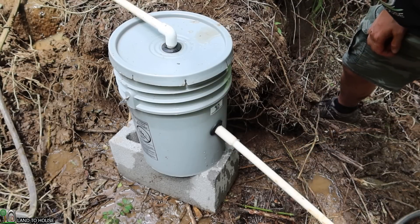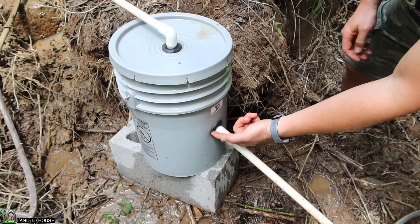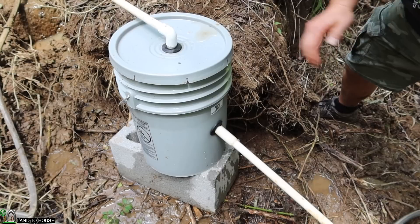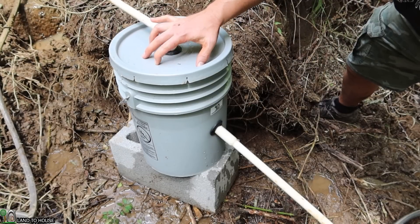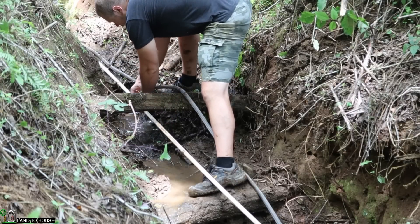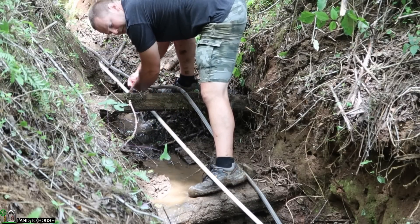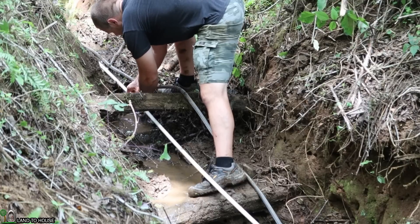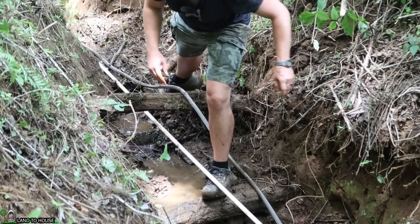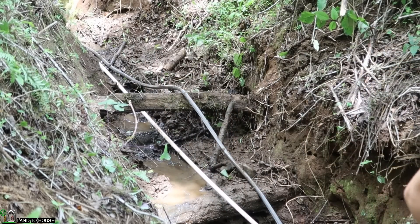Now because that has the head pressure drop down, it actually just pulled the bucket all the way down to here, but we'll work with that in a minute. The ram pump's not going to use as much water as is coming in, so we'll have plenty extra. Before we glue this, we're just going to do a test run. I'm going to connect another section of 20-foot pipe to the previous section. The half-inch pump pressure wave isn't super strong, so it shouldn't break that apart with just an 8-foot drop.